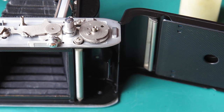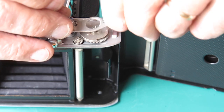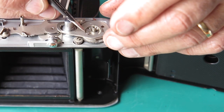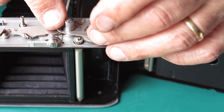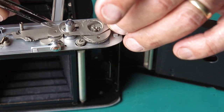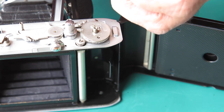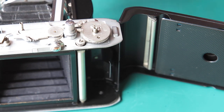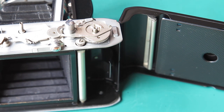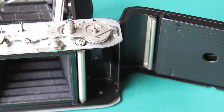This piece needs to go on. I'm putting some synthetic grease in the centre of that. Now that's driven by this eccentric here, that lump there. As the wheel revolves, that swings this piece in and out. I'll put some molybdenum paste on the bottom of this where it runs on that piece, like that, and on top of that